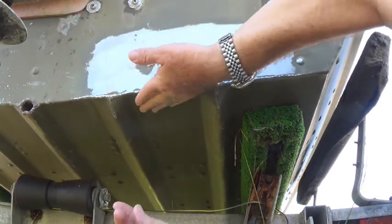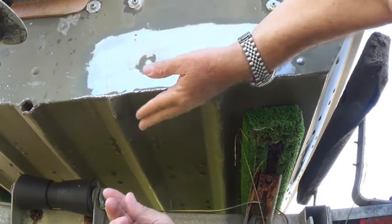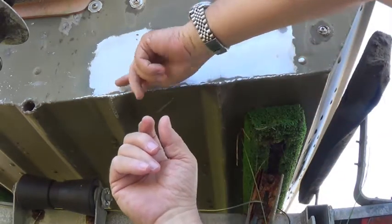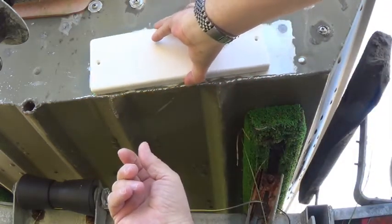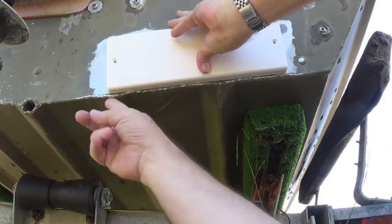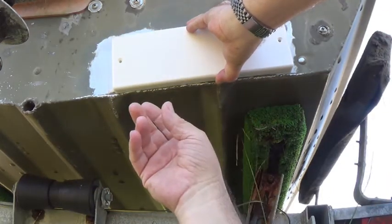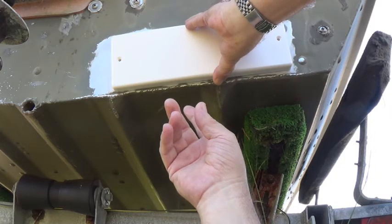This trailing edge has just a little bit of weld right here, and I don't really think that'll make a difference. Sometimes if you've got too big a lip, it will, but it isn't too bad. And it also says keep the block up about 1/4 inch from the end here. So I'm thinking I'm going to stay this way. That'll put the edge of the block right there, so this is going to be my edge line. That should work out pretty good. Then we'll keep it up about 1/4 inch just to make sure we're up plenty.